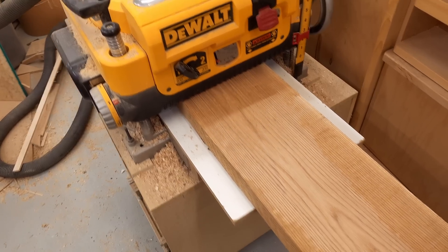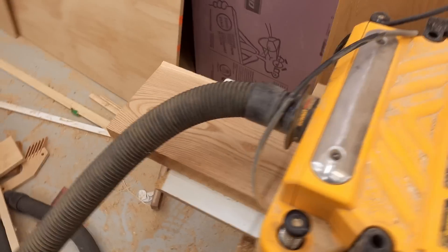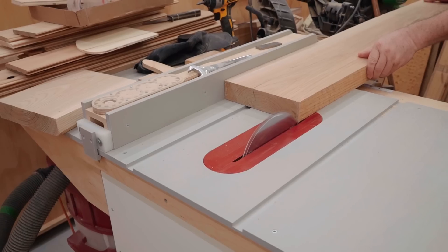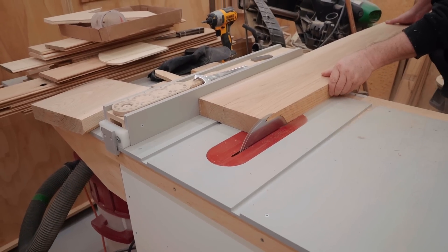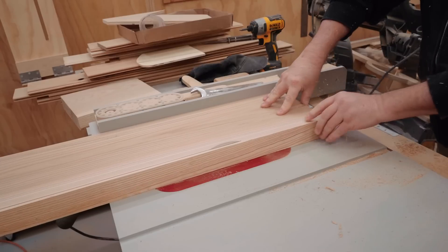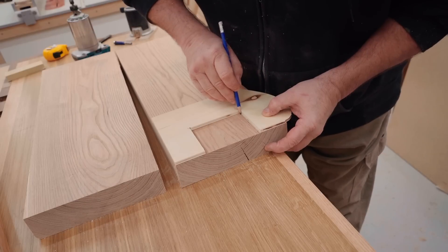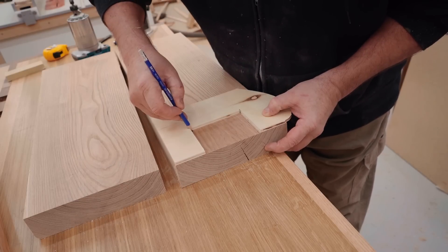First I'm going to make the baffles from this lovely piece of ash. This is rough hardwood about two inches thick and the first step is to plane it down and make it nice and smooth. With that done I can bring it to the table saw and cut off the edges, but not too much — I want to make sure this is as wide as I can possibly get from this board.